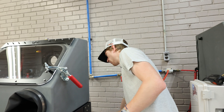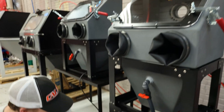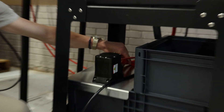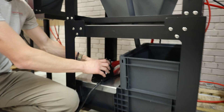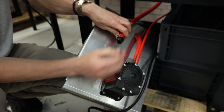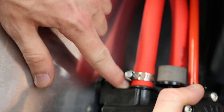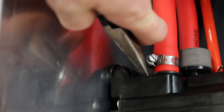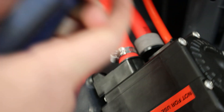The main thing you have to consider is that you need to hook the hoses coming off the back of the machine in — those are pretty simple. They hook into this diaphragm pump here. You're going to have the hose that goes into the basin, which is the center hose, and then the water hose which goes back up into your cabinet. When hooking this in, push it firmly in and make sure the clip snaps in just like that. This little clip here — you just push it down and that's what releases the hose. You put it back in, hold it, and snap it back in so it can't come out. Note: this is more difficult to do under pressure when cleaning your machine, so you might have to use a screwdriver.